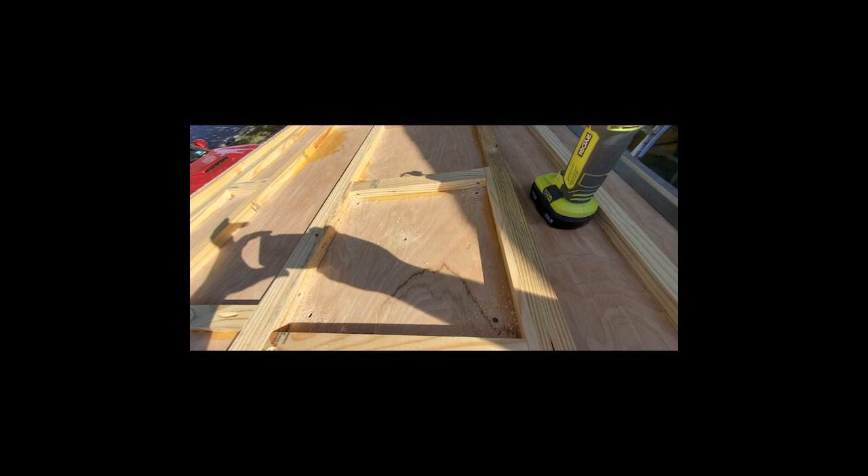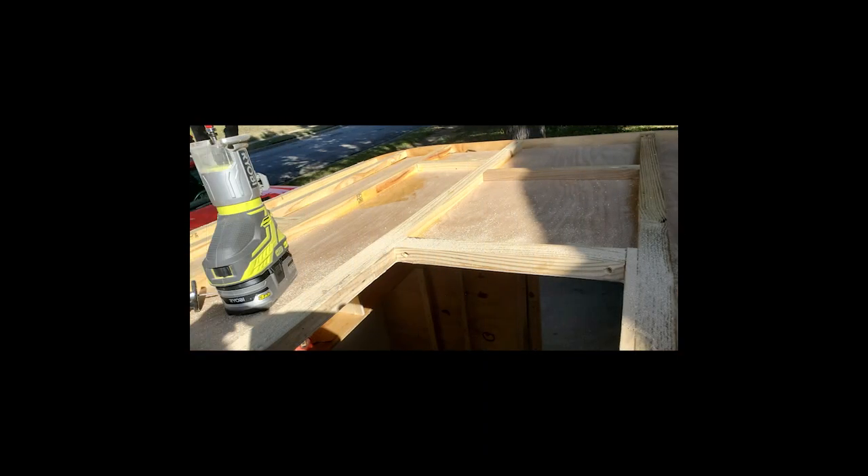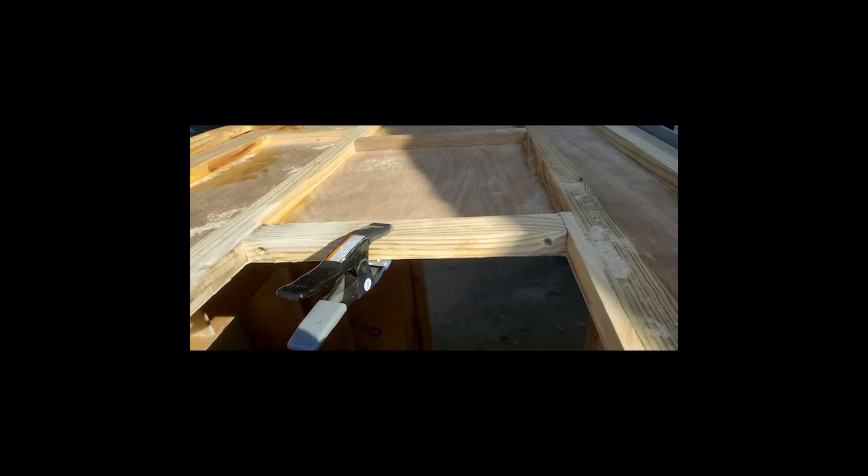Something else to note is this hole back here — this is where my main power line as well as all the wires are going to come through. I drilled that in as I was putting the ceiling in, as it helped me clamp things down better during the screwing. On the topic of holes, I also had to cut the hole for the ceiling vent. I pre-drilled a couple of holes into each corner, used my rotary cutter to cut out that hole, and then used the trim router with a flush bit to make it flush to the frame. A panel underneath was a little loose in some spots, so I just filled it with glue, clamped it, and waited an hour until everything was tight.